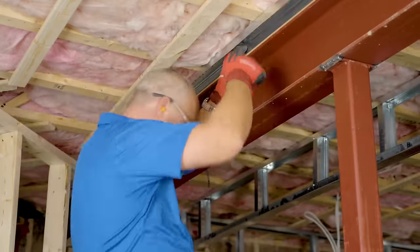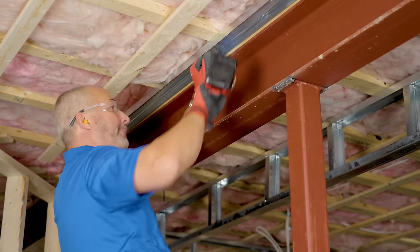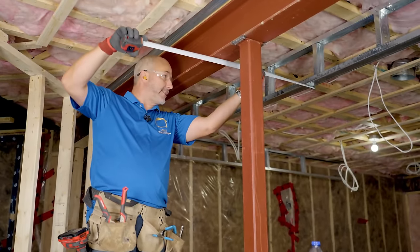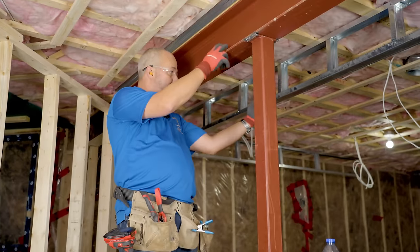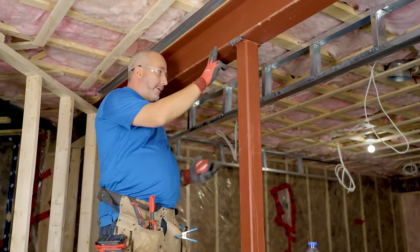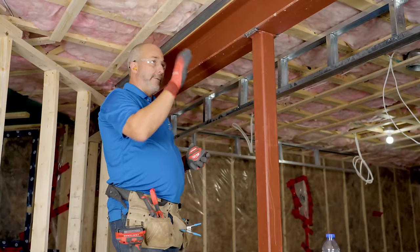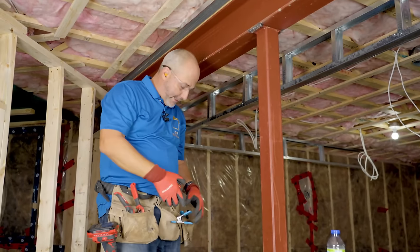I'm about to blow your mind — I'm going to be pulling it off the wall just a little bit here. The wood on the sill is in further than the metal, so I'm just making sure I'm going to clear that. I'm going to build another ladder right here. I have 24 inches to the far side of that steel to this edge — that's a pretty good span, but in truth it's only 21 and a half inches. I have a rule: anything more than 30 inches on a soffit box, you've got to add another support.